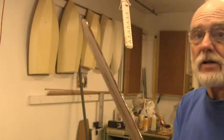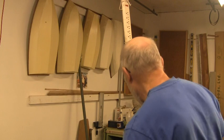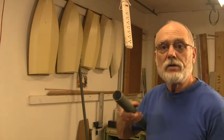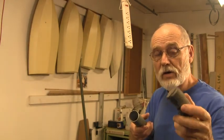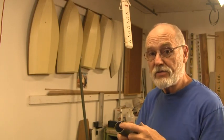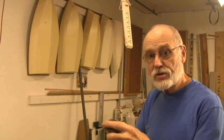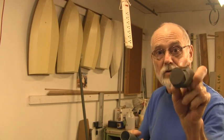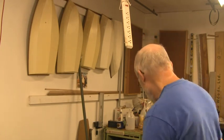You need to use that etching stuff in order to get any paint to stick to it. I'm probably going to prime them now. I've got my blades pretty much finished — I gave them a coat of epoxy all the way around on the ends and everything. On the inside, I had some old dense closed-cell foam from an old whitewater kayak pillar, to keep it from collapsing. To make tight-fitting gaskets, just take your pipe and push it down onto the stuff, and it turns out and makes you a nice little round filler.